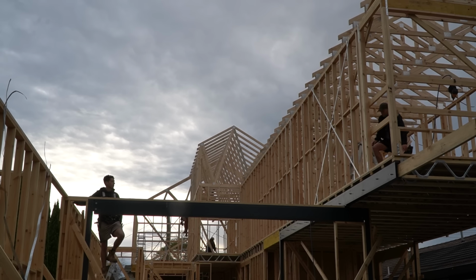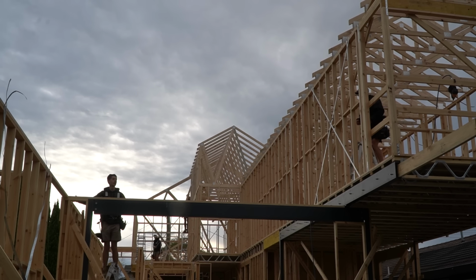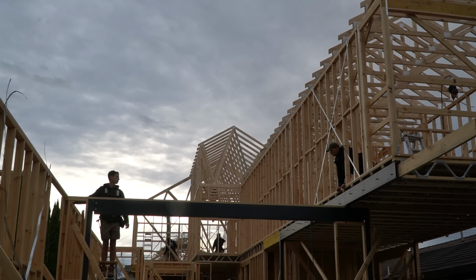What I'll need to get you though, you have this measurement here. I'll come down 1860 and measure off there. Yeah, and then let you know. Yeah. So I have 565. So write down 565. What we're going to do here is not a double pitching plate. Rafters are 900s, we're going to do 450 stud centers, and we're going to land a stud under every rafter. So we'll just do a single. So it's 565, we'll do a pitching plate at 529, we'll take a mill off that.